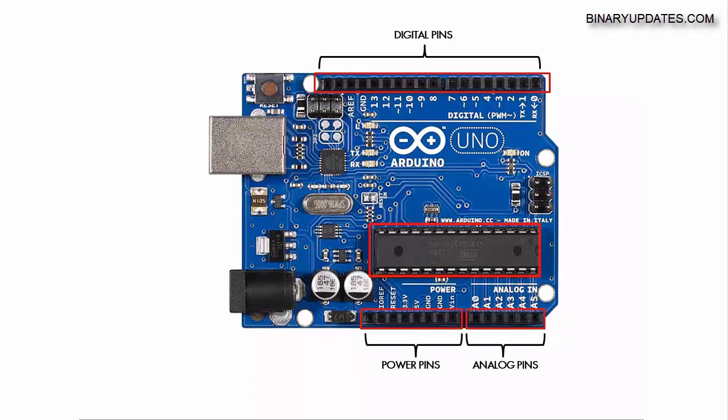Some low power devices — such as certain sensors, Bluetooth modules, and Zigbee modules — need 3.3 volts, not 5 volts. Whereas devices like LCDs and motors draw more power and need 5 volts as input voltage. Sometimes you need 5 volts, sometimes 3.3 volts, and of course you need plenty of ground pins so that when you connect your circuit on a breadboard it doesn't look messy.